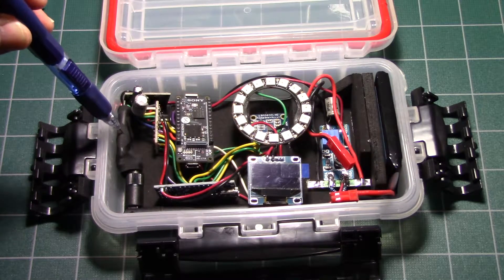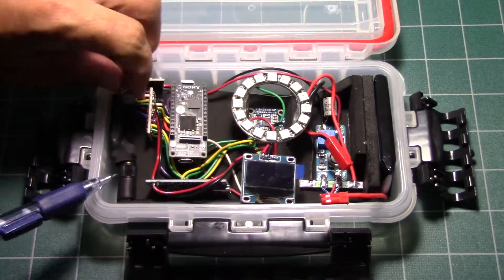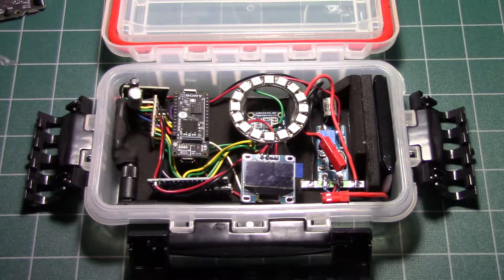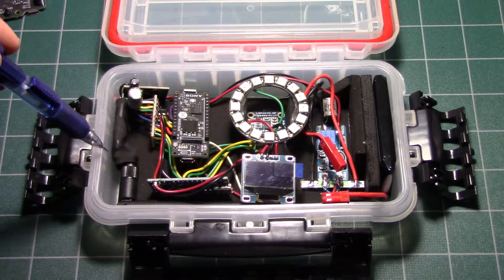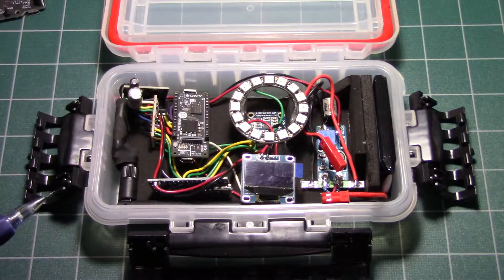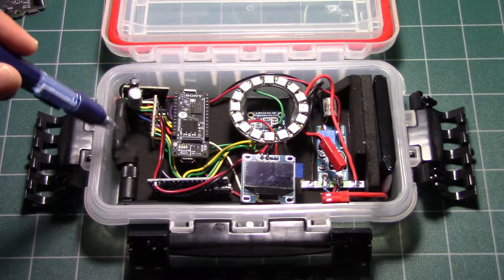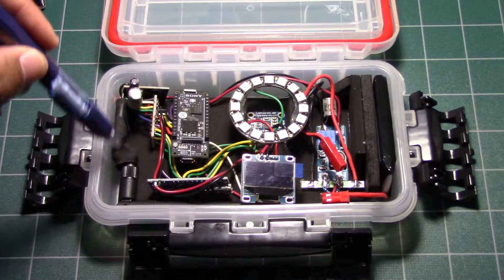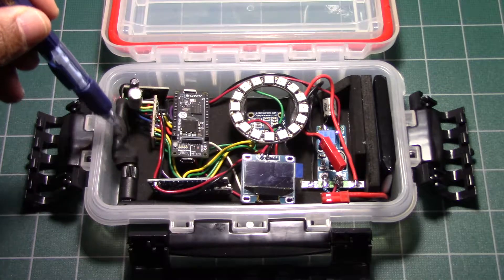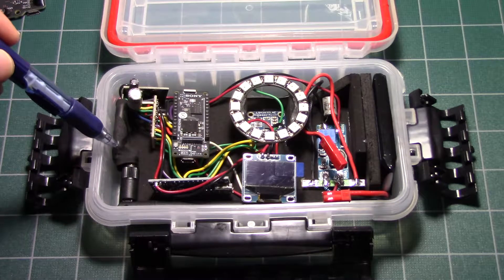Another thing — this module is wrapped up. It's a bare module, you can see all the circuits, but it's covered in shrink wrap. Looking on the internet, people said you can increase the distance by wrapping it in saran wrap, putting foil over it, and making sure the foil touches one of the grounding points to act as a shield. Instead of saran wrap, I had shrink wrap left over from a fishing boat. I put one layer over, added foil, used copper tape to make sure there was a connection between the ground connector and the foil to be a shield, then wrapped it again in one more layer of shrink wrap so I don't short anything. That's why it's all black and covered.